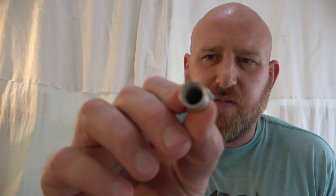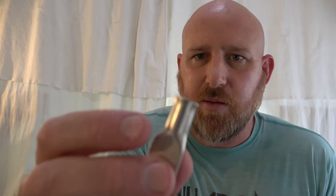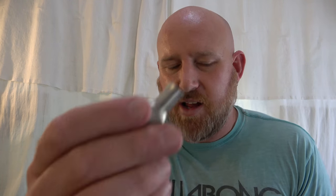So I'm custom cutting, and then I've got these big wire cutters, which is awesome because the standard wire cutters are not gonna get through AWG2 wire. I also have these lugs that are going to go on the end of the wire. They're fat. It would be very near impossible, especially to do a good job with the 4 AWG. I was able to take some channel locks and squeeze really tight and crimp it myself, but with these I'm not going to mess around.